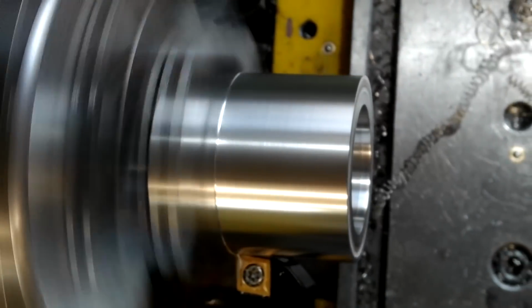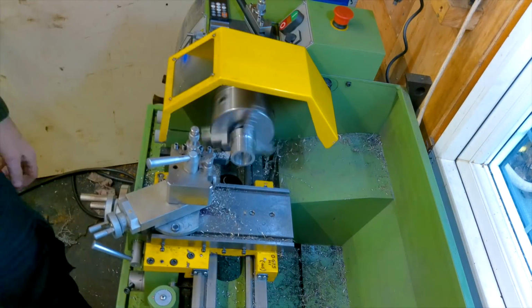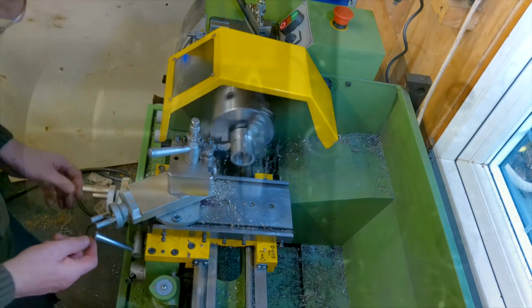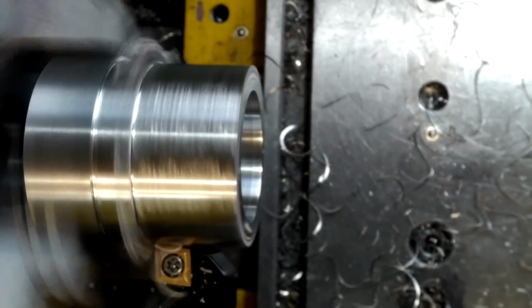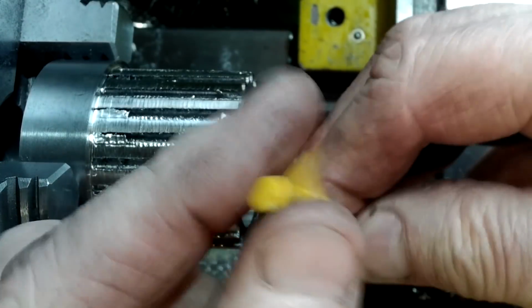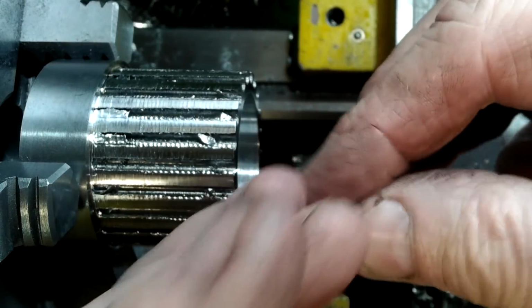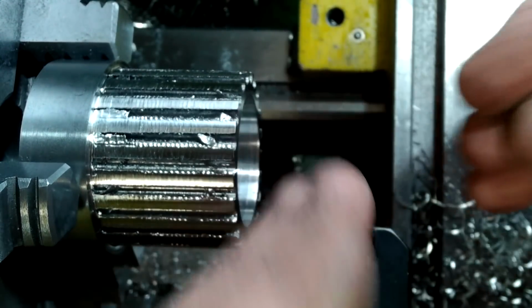Machining the outside diameter was okay until I started to hit the intermittent cutting stage that was over the drill holes. Then, as luck would have it, the edge of the tip broke off, so I had to change it to finish off to size, plus a few thou for final finish later. Just hate grubbing around in the suds tray to retrieve my insert and retaining screw, but I've been out of practice lately, so here goes. Oh.